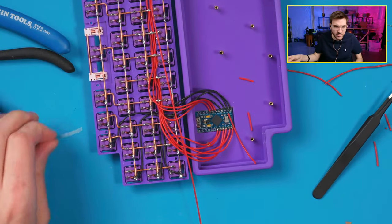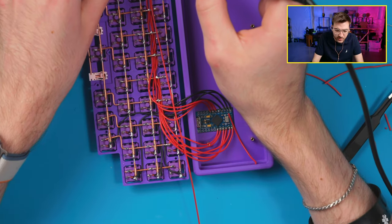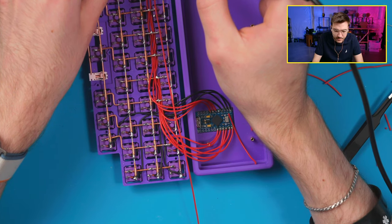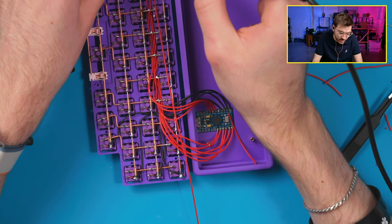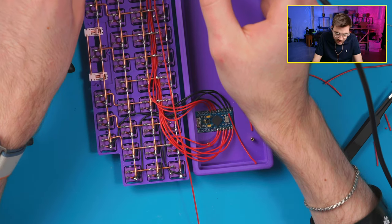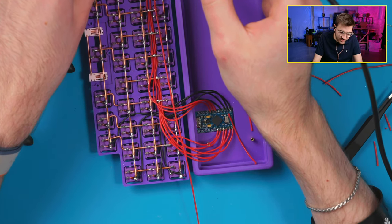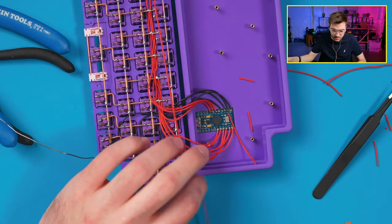They also do make HEPA extractors for soldering, like actual soldering ones, but they get really expensive, like $400-$500 minimum. They have like hoses and stuff you can kind of direct right over your work area, and it's kind of overkill for home soldering, especially if you have access to a window. If you can just vent stuff outside, just do that. That's even easier. If you live somewhere, you can do that year round.